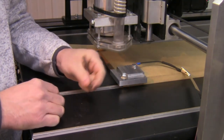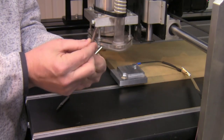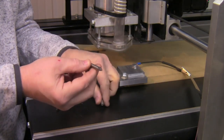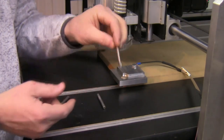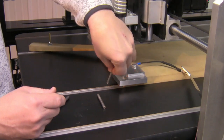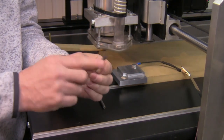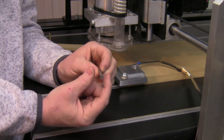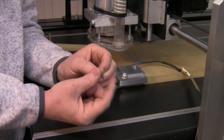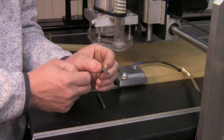If I was using something like this quarter inch 60 degree V bit, the widest diameter is at that quarter inch and I can get down low enough to touch off with that bit, so I don't need to substitute it with the touch pin. But you always touch off at the widest diameter of the bit. So if your V bit has a half inch or three eighths inch head, you always touch off at the widest diameter of that bit.